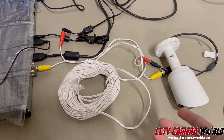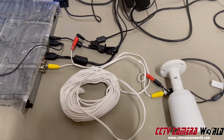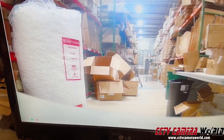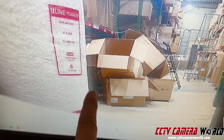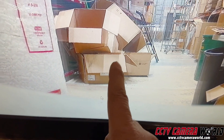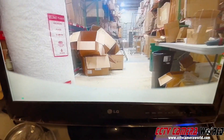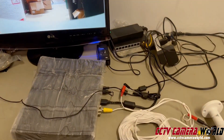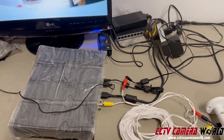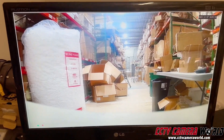Now I have the camera connected with the thinner wire and it seems to be working fine, but if you look closely you'll notice there's ghosting going on. There's some ghosting from the peanut bag, and you can see some of it along the edges of the boxes — you have to look very carefully. So how do you fix this? It's happening because you've got a thinner gauge cable. The ideal thing is to replace the cable, but if you can't do that and you want to fix this, here's what you need to do.